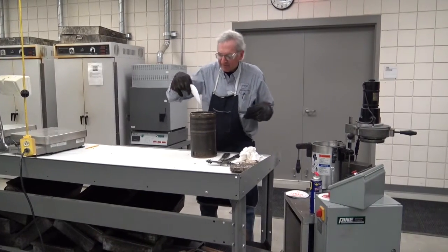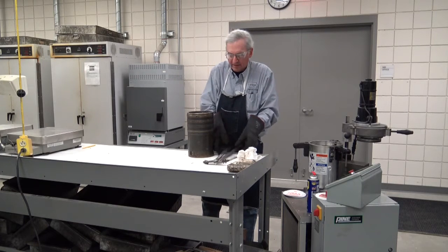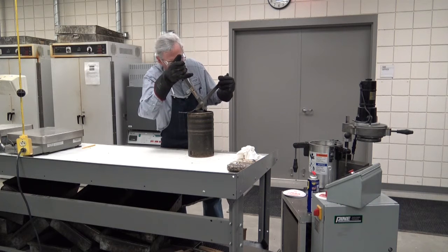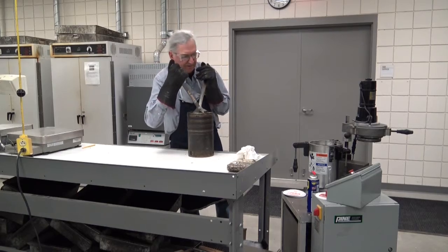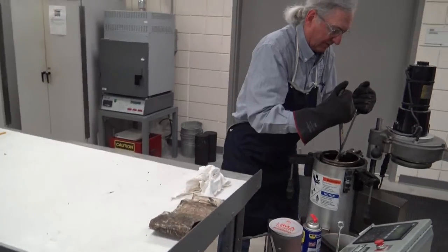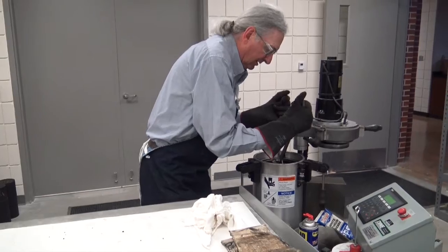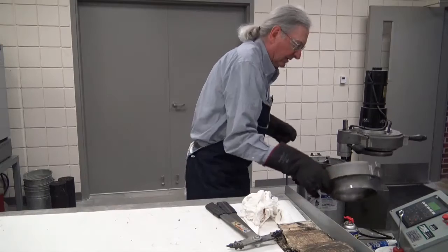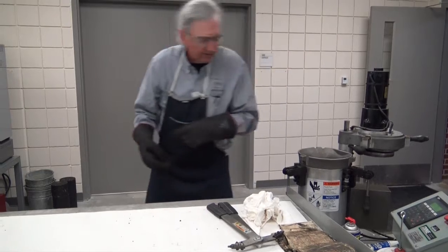The molds need to have been in the oven at 275 degrees. You have to put a paper in the bottom so that the asphalt material doesn't stick to the plates. With this particular device, it's actually easier to load the mold once it's been placed in the gyratory compactor. These molds are very heavy. Slip the mold down into the gyratory compactor — in this case, we have to move it a little bit clockwise until it seats itself. A little collar we can put on here to facilitate transferring the material in.